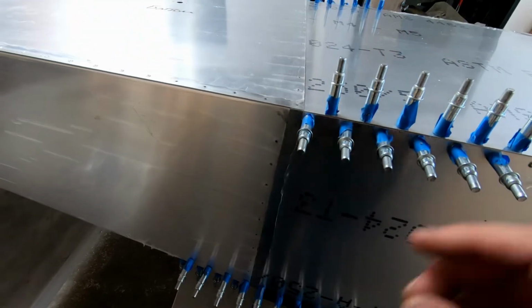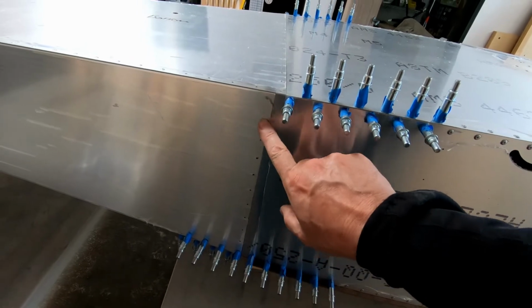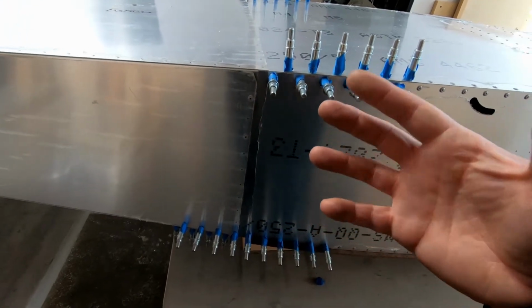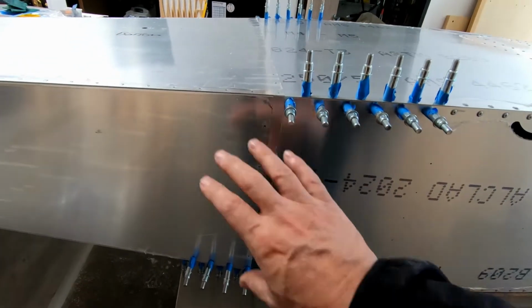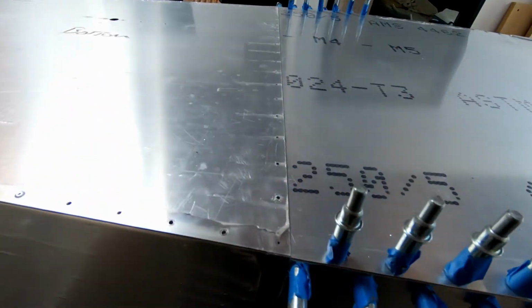So I've left frame 7 out, and I'm not going to worry about frame 7 because all frame 7 does is tie these two skins together once the angles and everything and the size has been determined, which is determined by these angles basically pulling this fuselage outward and kind of blowing it up and making it the correct height and width for frame 7 to fit in there.